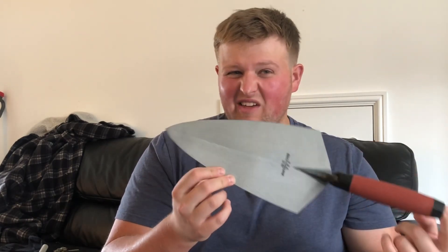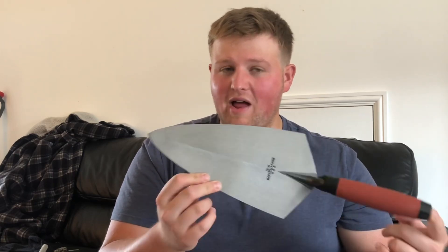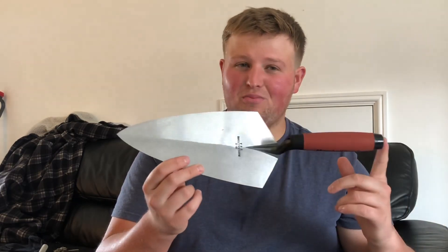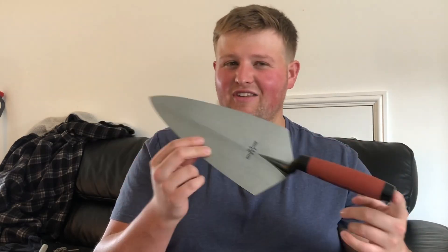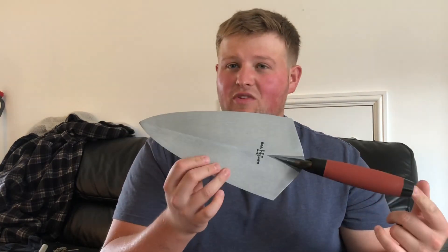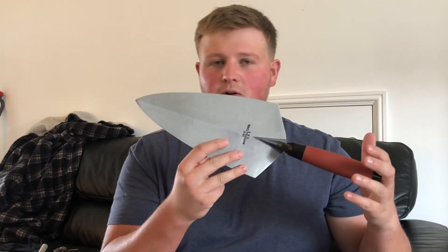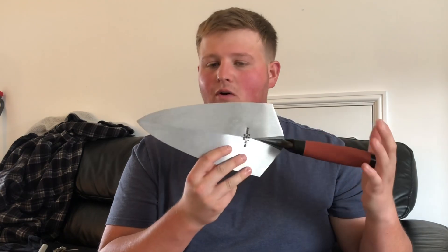When it comes to a 12-inch you can get four bricks out of one blade full of mortar, and with a 13-inch you can almost get five or six depending on how you weave and spread. The old saying in bricklaying is that you need to be able to spread for six bricks with one trowel of mortar — it's a bit of a myth, but I've seen it done with some of the big trowels. Some of the spec mix guys use massive spades, which feels ginormous to me.